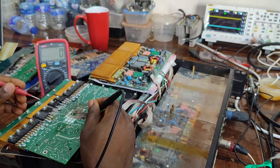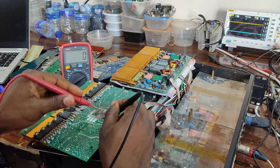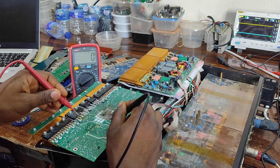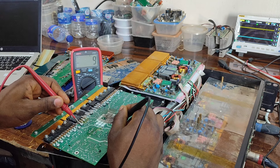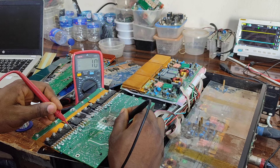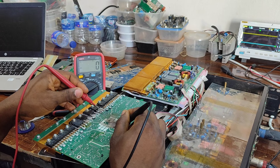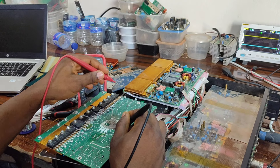I'm going to take the measurements because this amplifier has a lot of voltage in it. It's coming in at 152 volts positive and 152 volts negative. This stage is stepping it down to eight to ten volts for the positive rail, which feeds the power transistors up here. The negative rail goes from minus 152 volts down to negative eight volts on the output.